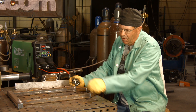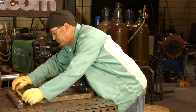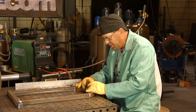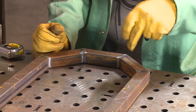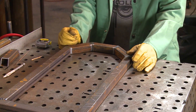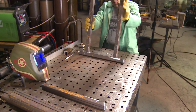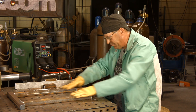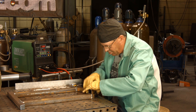Welcome back. I went ahead and tacked up — welded the caps on the bottom shoe and tacked up. I am straight and square. I'm going to sister the other one right on top of this since I know it's good. I'll turn this over since I have tacks on the top and in the corners down low, and sister the other piece on top so they're exactly the same. Then I'll put a couple of spacers underneath and square everything up.